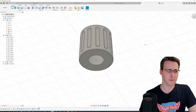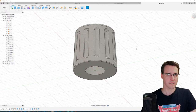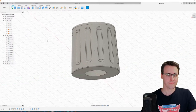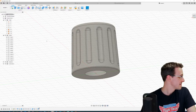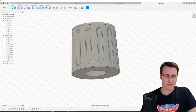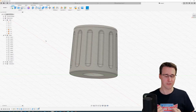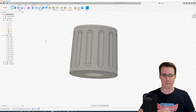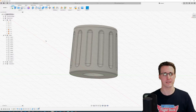And now we will have to place the set screws again. Again, I'm using these 3mm set screws. I'm thinking if I only use one in this button. I know that I have said before two set screws are better because the fitting is better on the shaft, but a potentiometer doesn't need very much force to turn. And so I think the risk that this knob will slide through is really low. Yeah, let's try one.